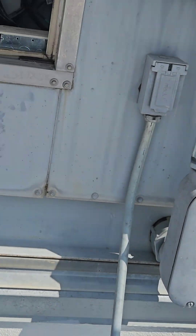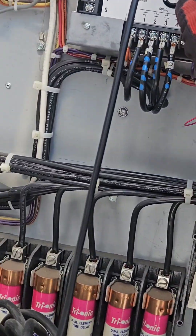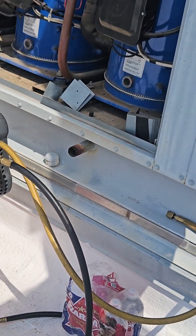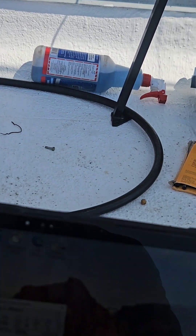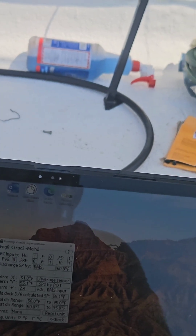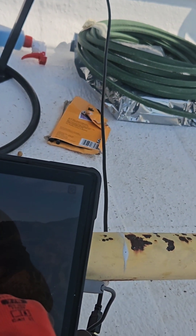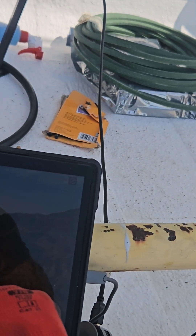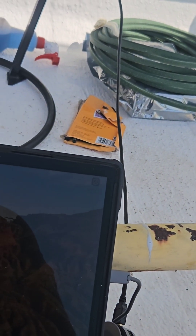I'm going to go a little bit more, try to get it to 55. Yeah, that's pretty good. I don't know why the automation is calling for a 61-degree discharge air temp setpoint - that's quite high.